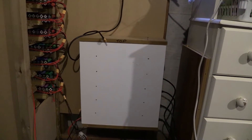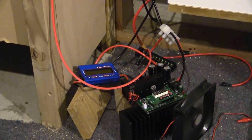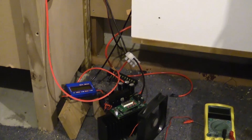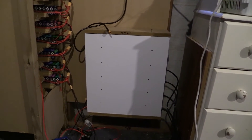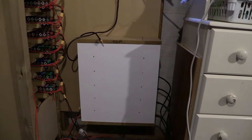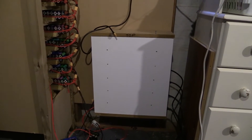This is going to give me a heck of a lot of power to be able to use with these boost converters. Currently I've got 55 volts plugged into the input. I'm going to be using two boost converters in parallel to be able to charge the power wall. I can obviously add a few more boost converters, and the power supply is definitely going to be able to power it. All in all after updated calculations, it's around 2255 watts — which is around 41 amps at 55 volts — so it puts out quite a lot of power.